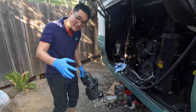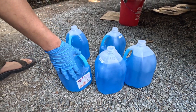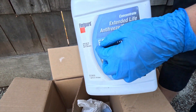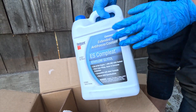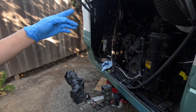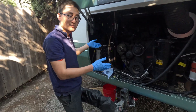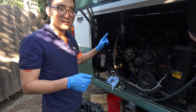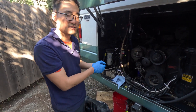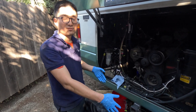This is one of the last few steps. I have pre-mixed the coolant with distilled water. This is the original distilled water bottle from Walmart. I still have one can of coolant — this is the coolant recommended by Cummins ES Complete. Mix 50% coolant and 50% distilled water. From what I can tell, it probably uses close to 10 to 12 gallons, so I mixed 12 gallons of 50/50 coolant. For the last round of the flush, I added about 9 gallons of distilled water, let it run for 20 minutes, then drained all the water for a final flush, and then added the 50/50 coolant mix.